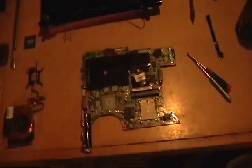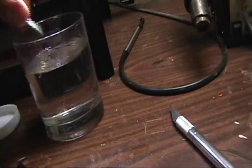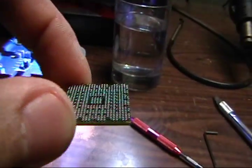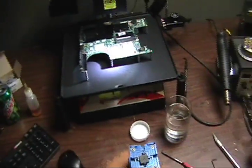The chip is reballed and the board is cleaned off. It's still the same laptop, still all taken apart — here's the reballed chip. Let me dip it in the MEK real quick. Nicely reballed chip. Here's the chip, here's the board, and there's the spot where it's going to go. I'm going to put it back on just like I do in my other videos and then test it out.